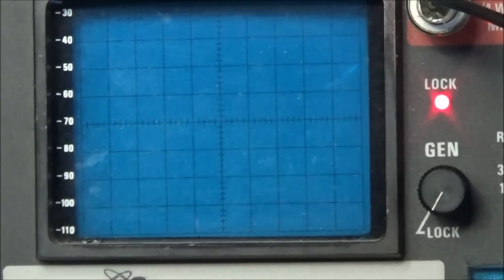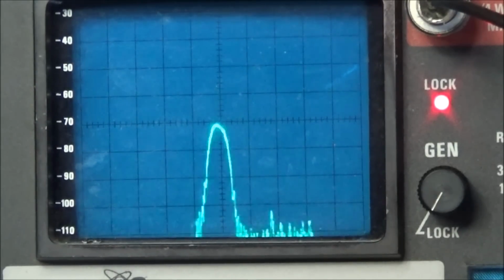Okay, I got the board back in. I have checked. We still don't have RF power out the PA unit, even after replacing that blowed out resistor, and our spectrum analyzer is trying to work again, so we can take a test with the spectrum analyzer.